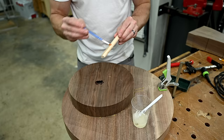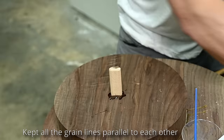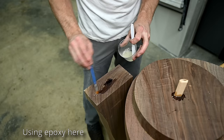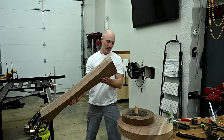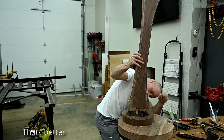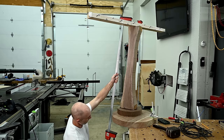I did the best I could at lining the grains up to run parallel with each other from each section, because all wood continues to expand and contract across the grain seasonally. If I'd mounted these perpendicular to each other, there's a really good chance you'd get cracking and separating between the two pieces. I also mounted it backwards at one point, but luckily I wasn't using super glue. Got it mounted in the right direction and had to get a little creative with my clamping style, but in the end I got it pretty good.